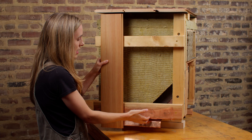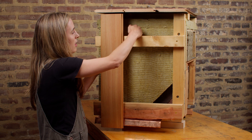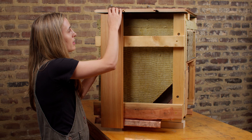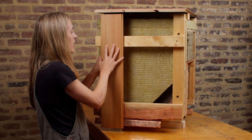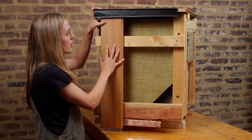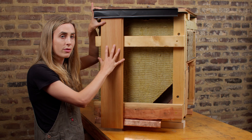We'll have a bug screen down here and up here, and then this nice air gap behind our siding. We'll leave a nice gap here between our roofing sheathing and our cedar siding. This is to mimic our metal roof — you can see how the air can circulate throughout our siding system and throughout our roofing system.